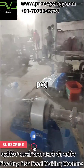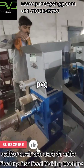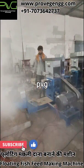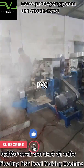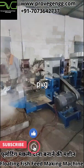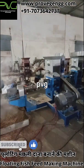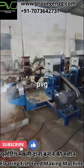The pellet coming from the extruder has a moisture of 18 to 20 percent, which is not safe for storing the material for a longer time. So we have to reduce the moisture content, and for that purpose we use a dryer where we dry the product to 10 to 12 percent moisture. This material is then safe for storage. Further we cool it to room temperature using a cooler, and the last step is to spray fish oil or a combination of fish oil and edible oil over the pellet to create a good aroma so the fish can easily catch it.